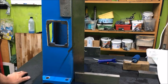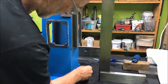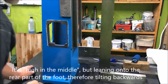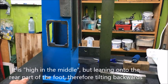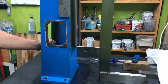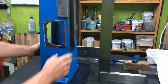Which is considerable. Freestanding, the column mass — I can barely fit the five hundredths shim. Four hundredths goes well under, a little bit more on one side than the other. If I take a three or two, it's tempting to go under. So there's a bit of a rock here — it's high in the middle. We will see that also when we blue it up. It could be that if we blue it up and rock it, it will blue up all over. We'll see how that goes.